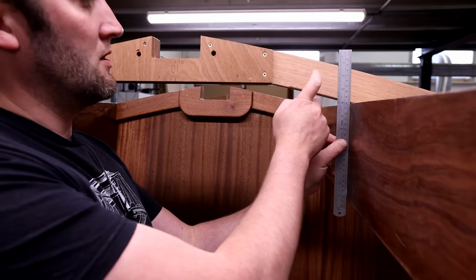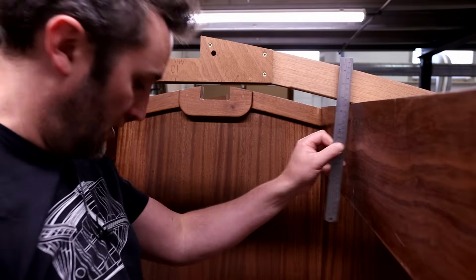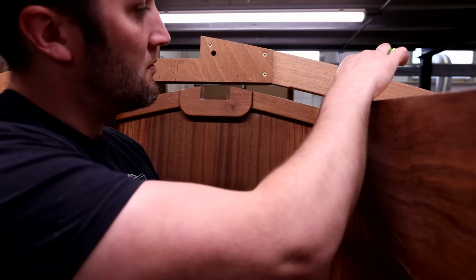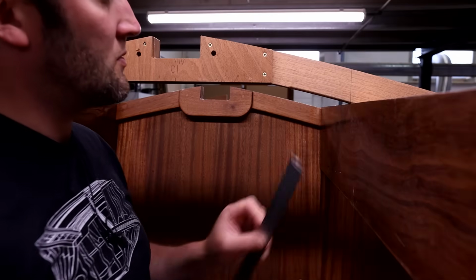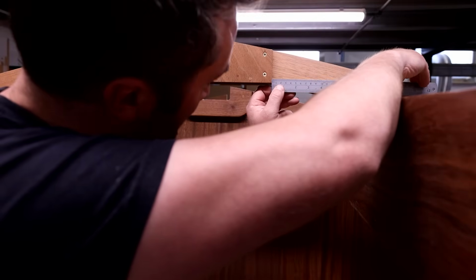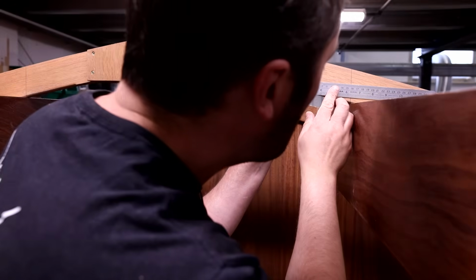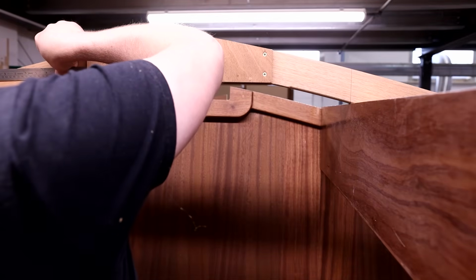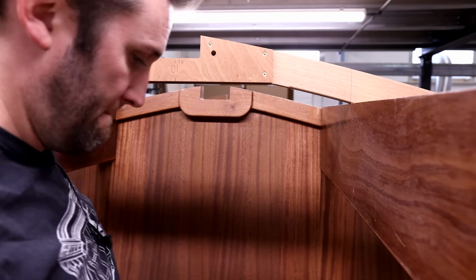That's where we're going to be cutting this, but we also need to cut the thickness of this ply out, so we're going to do 2 cuts through the frame. So we'll mark the inner one first. Just double check that is equal on both sides. 156, 157, 157. That's good. Okay, so I can take this out and now do that cut.